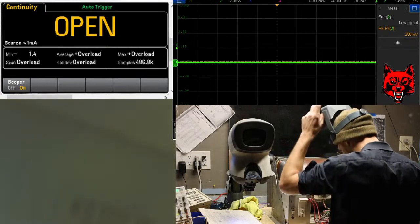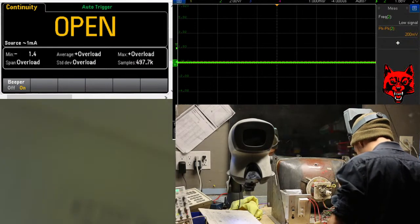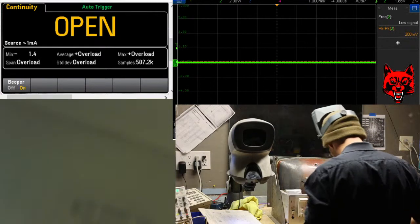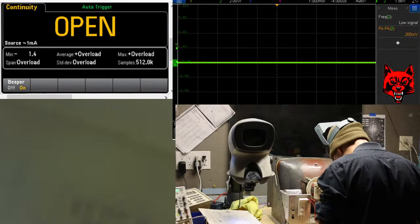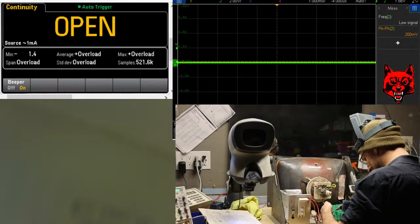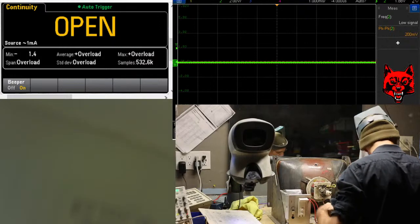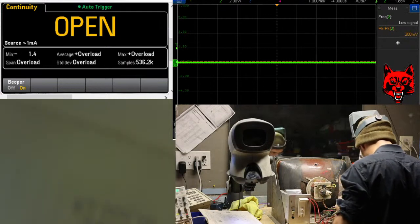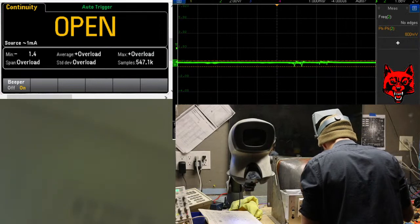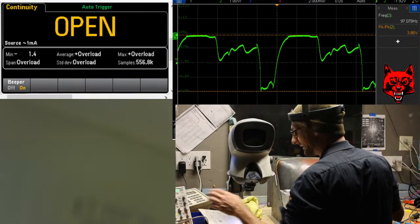Alright, power it up, right? Oh, see it? Here's a frayed wire on the neck board. I was just talking about that. Jeez Louise. Wow. We would have lost our heater voltage. I'll get it there. That doesn't look too good.